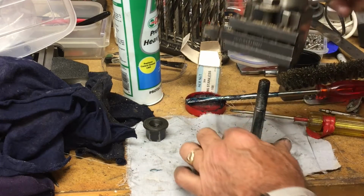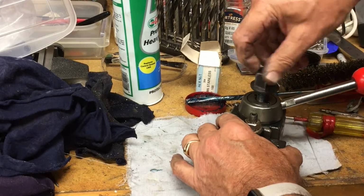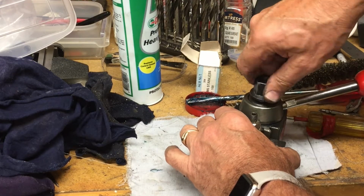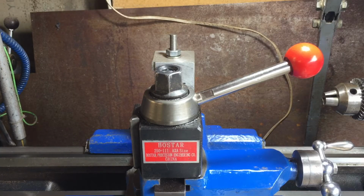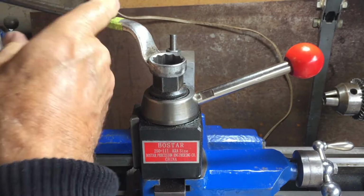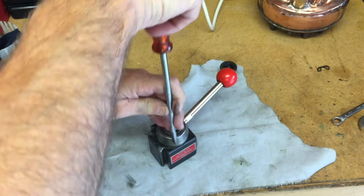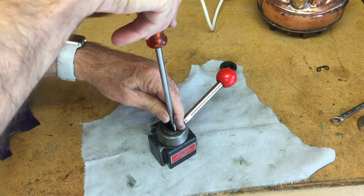And when you've actually mounted it on the lathe, this bolt goes through the middle and clamps down on it and holds it in place, but as soon as you loosen it and turn it around, each time it must alter the adjustment. So I'm going to take it apart and see if I can possibly put a washer or shim in there to allow us to tighten it down. Okay, so this is really just like a big screwdriver slot in the top here. I should ideally make a little tool to screw it out with, but it's not hard to undo.